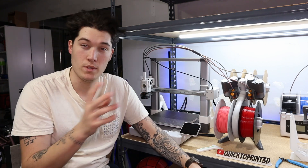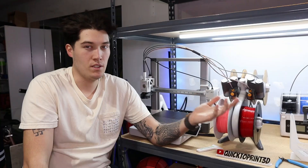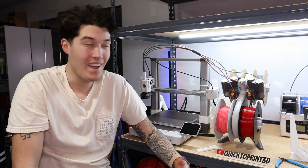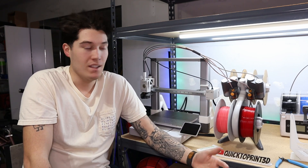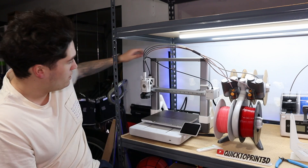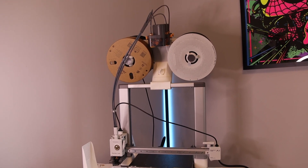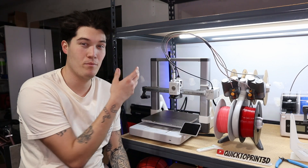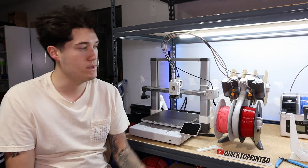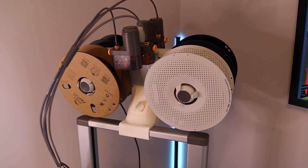I also think the A1 is a lot more sturdy than the A1 Mini because it has a two-pillar system. The A1 Mini has a single arm, so I've had more prints mess up on the A1 Mini than on the A1. A few times when it's doing a print really fast it shook — it's not common, but it does play into sturdiness. One print getting messed up can really suck — you start a seven-hour print and come out to a bunch of string. That's happened to me maybe two times, but it's happened more on the A1 Mini. The two pillars supporting the Y-axis just make it a lot sturdier and you can trust the prints to come out. Both printers have apps and are super easy to use — they're about the same when it comes to compatibility and ease of use.